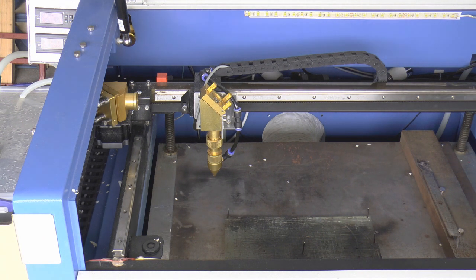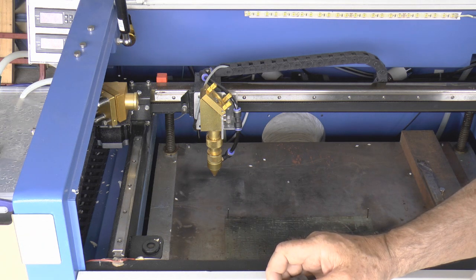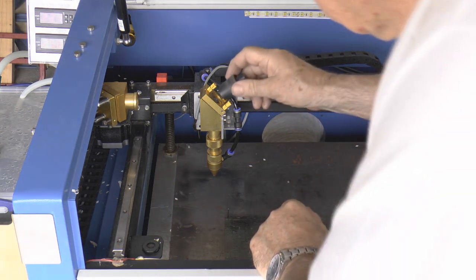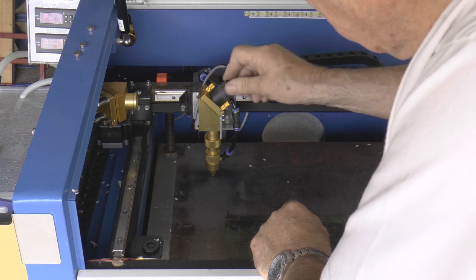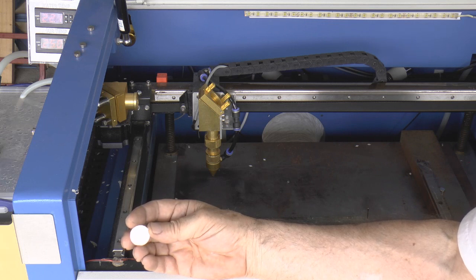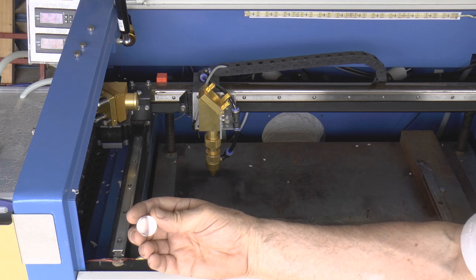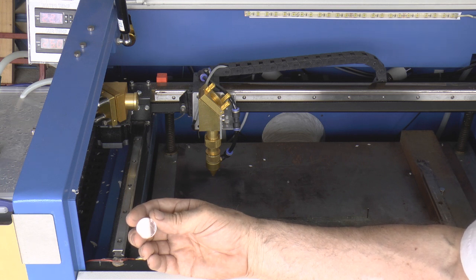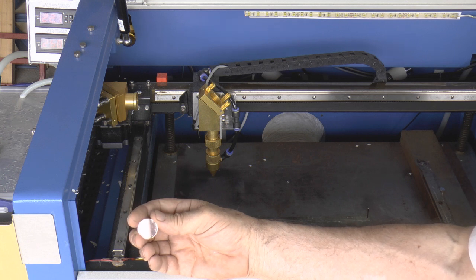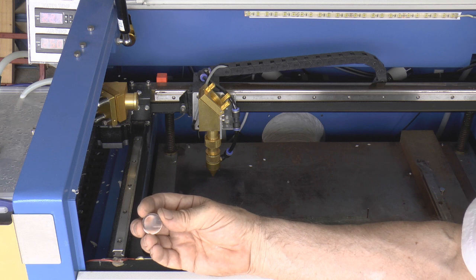I finished up making my own copper mirrors, and those have been in here for about six months now. This is the first time this mirror has been out since I put it in - and you saw me fit it on video. There is a small amount of oxidation on the surface, a very small amount, but I'm absolutely sure the reflectivity at 10.6 micron wavelength is not going to be affected. When I did my reflectance tests with raw oxidized copper it was still giving around 96 or 97% reflectivity, so I'm very confident it's still delivering quite a reasonable amount of power.